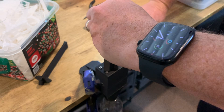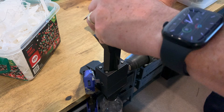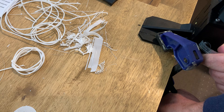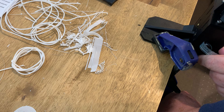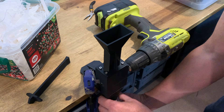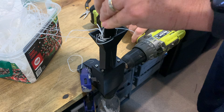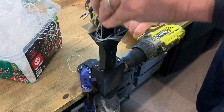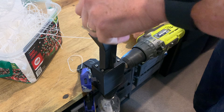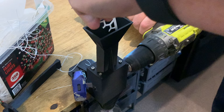The first test was a little daunting mainly because I knew the kind of pressure this would be under and I wasn't sure if it would explode in my face. The clamping foot as part of the main body is a great feature so I clamped that down — with surprise surprise — a clamp. I fed in a small amount of scrap, attached a cordless drill and it shredded pretty quickly. It was a little chunky but compared to the manual cutting I was doing for my other video, I can see this is a game changer that's going to let that project continue.